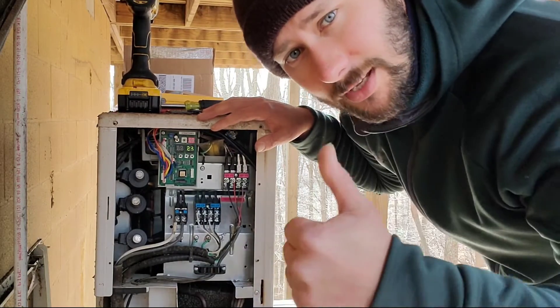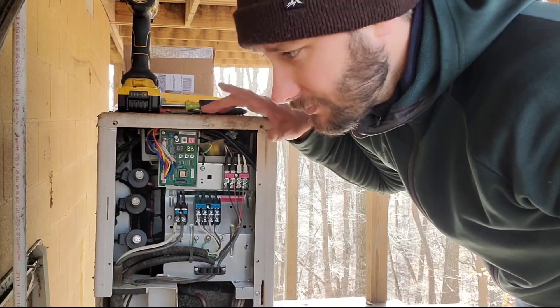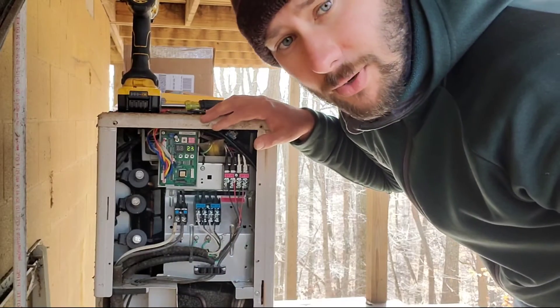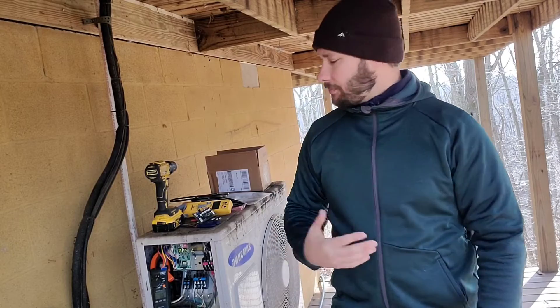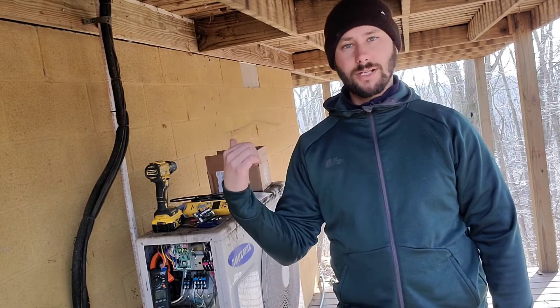Guys, I'll have this thing up and running — we'll be in good shape. Make sure you set the dial properly. Unplug the disconnect and disconnect power when you've got your hands in here changing parts. I just wanted to tell you what error code E337 was — which is an open or shorted sensor — and you're able to use a meter, set it to ohms, measure each sensor at a time, and check your resistance chart. Make sure you know the temperature outdoors or the temperature on the line, because you're going to be more accurate checking the resistance chart values. Easy problem. You've also got OLP sensor, discharge sensor, outdoor ambient sensor, and coil sensor — those are a separate set of sensors on this unit, so you definitely need to know how to check the sensors out in the field. Thanks for watching and remember: I'll keep you cool if you let me.